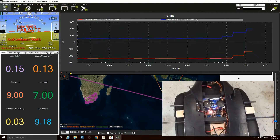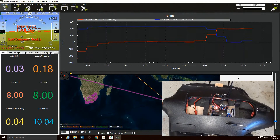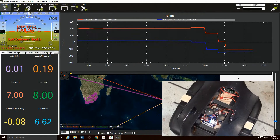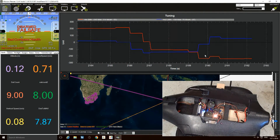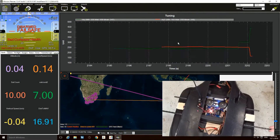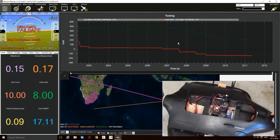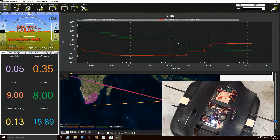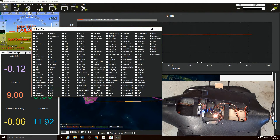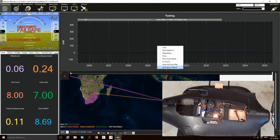So you'll notice when you spin it — it's looking good so far — they should move in the same direction, they shouldn't cross over. Now they've crossed over, so the autopilot's going to have a hell of a time trying to figure out what is what. Do the same for the Y axis. Notice how they're diverging and converging — in that case they're converging and then crossed over. What you want is for them both to move in the same direction.